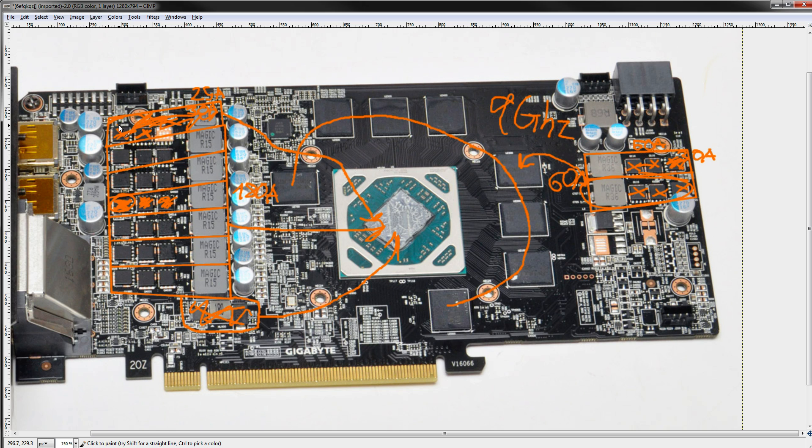For today with the Gigabyte, I'm going to say: if you care about PCB quality, just don't — it's worse. It's worse on continuous ratings. That rating is really the baseline and it loses on it. While this might not blow up while overclocking, it's certainly worse than everything else.